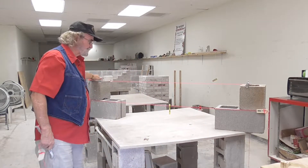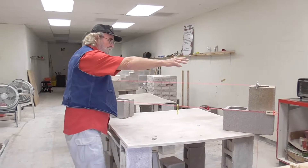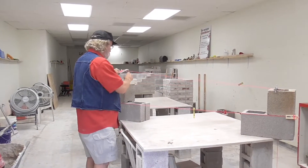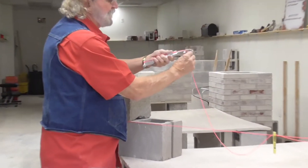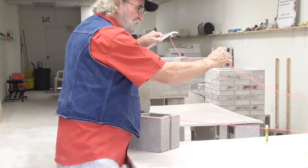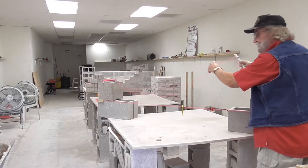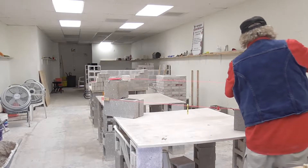Which is what I have here — you've got six courses on here. The reason you do that is because you've got three or four bricklayers in here. You can't see the pin guy, you can't see the pull guy. So you finish the course and you put the line up. All you have to do — let's say the line was here — take it off, roll one off, and stick it back on. Put it up here. And then before you do anything else, you pull it, tag it. Because the guy down here on the pull end can't see you, he doesn't know when you're up. So if he pulls the line, I feel the tug and I know he's ready to go.